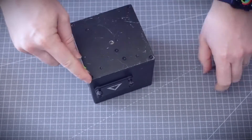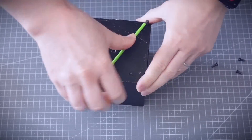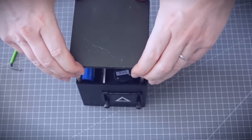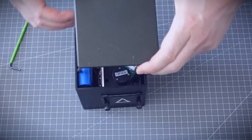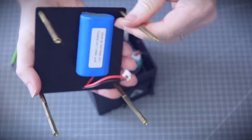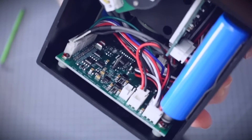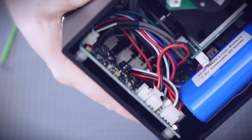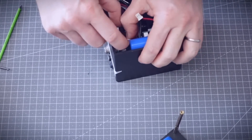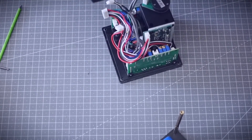So let's get this open. You can see there are these four main screws that hold the bottom on, and then if you turn it around the other side you can lift the top side out. You can see there are these hex standoffs that run throughout the length of the cube that hold the entire thing together. Here's one of the battery packs affixed to the lid, and you can see inside there's the main control board and the other battery pack. Once I unclip all these wires it frees the main controller board from the rest of the laser components and I can lift that enclosure off.